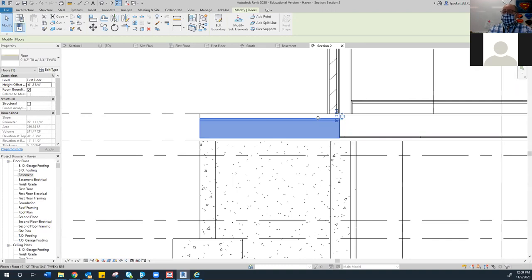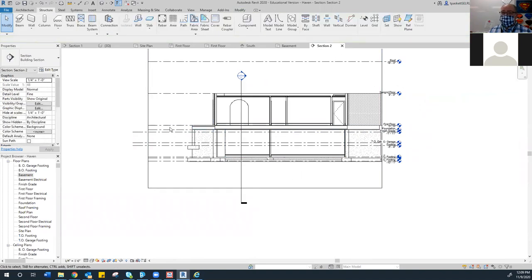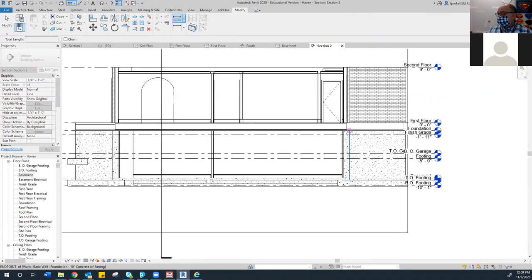Now, keep in mind this though. If I look at the whole section of my building here, and we're going to be talking about this very, very quickly, if I measure from where this foundation is all the way to the front, that is 41 feet. I might be able to do that with all the same size building material. That would be cheaper. If I can only span 36 feet though, and that's a big if, then I'm not saving any money. So when we talk about spans, this 9 1/2, some of you may change that depending on the size of your house. Whatever makes it cheaper, that's our goal.